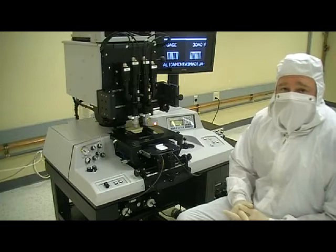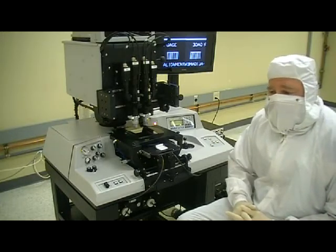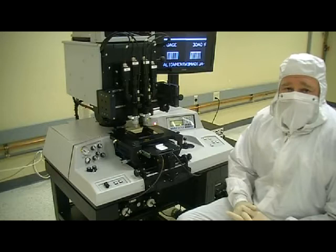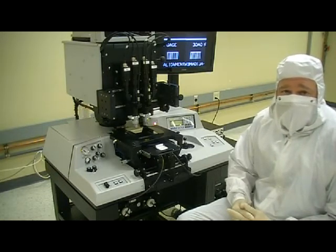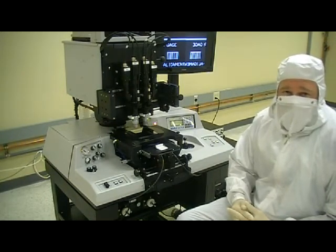It still uses the same air-bearing leveling system, which is an incredibly precise and gentle leveling system that's ideal for fragile substrates. It allows the maintenance people of the machine to set up for ideal leveling in virtually any type of substrate that you could process on this tool.